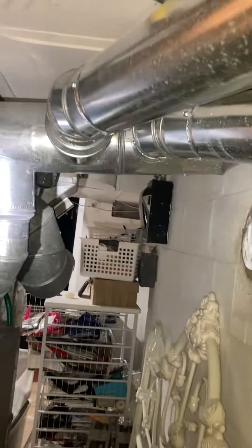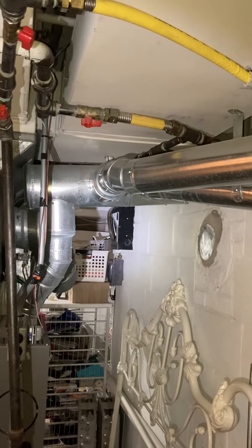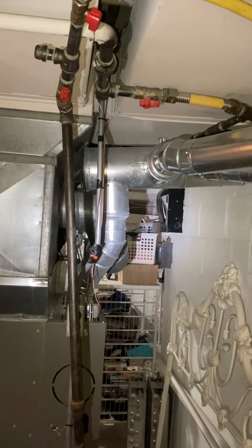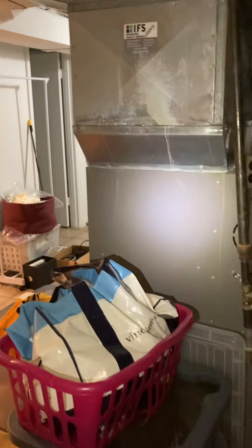I don't see the UL tag on the liner, but it looks like the water heaters have been updated recently. On the swivel tee, it's kind of extended — you've got four inches going to the two water heaters, and then it's dropping down to feed our 80% efficient furnace.